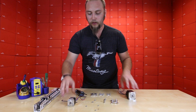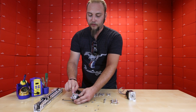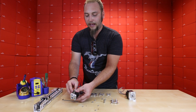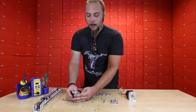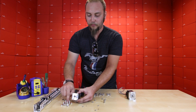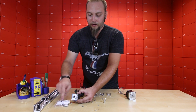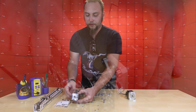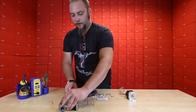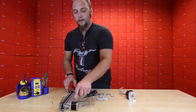I'm going to show you how this works assembling the bracket using this smaller stepper motor. You can see I've already attached the bracket to the stepper motor. With the smaller size, it actually comes with four Phillips head screws that come from the front of the bracket and go into the stepper motor, because these motors have threaded mounting holes on the front. I'm going to remove those, take this bracket off, and go from the back to connect the standoffs from this bracket, giving us the clearance we need from the drive shaft to an adapter coupler. Now our smaller stepper motor is connected to this linear slider.